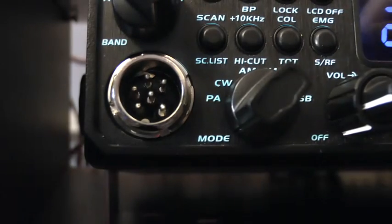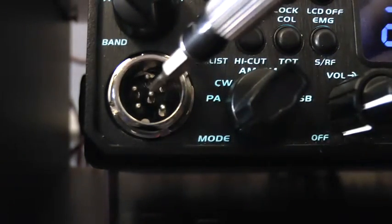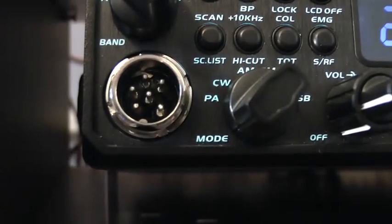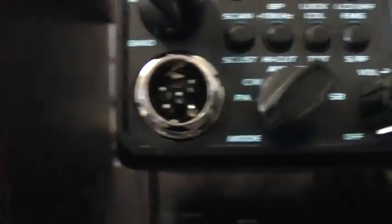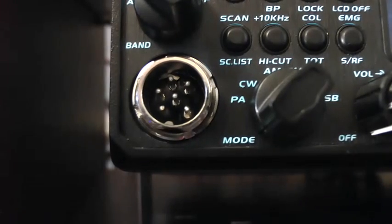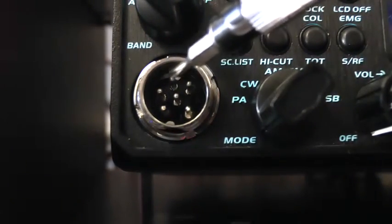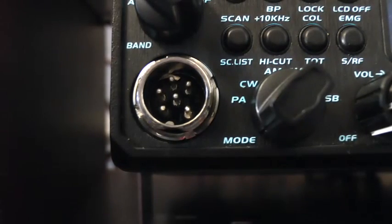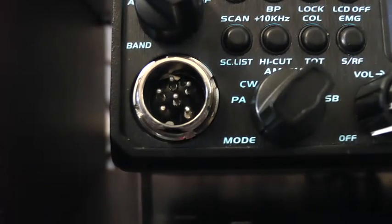In the case of the CRE8900, it's the centre pin — this one here. You need to be very, very careful that you don't get any connections between that pin — pin 6 — and any of the others or the ground, because what happens is you feed supply voltage 13.8 volts back into the radio. We call it the pin of death.